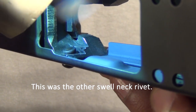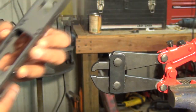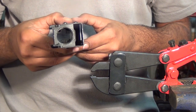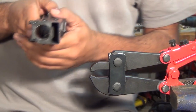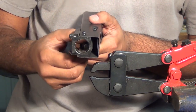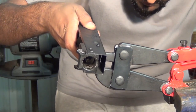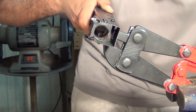Now if you can see, that bottom rivet head is not square — it's higher on one side than the other. The reason that happened is the receiver may have been twisted. When you go to fix it, you want to overcompensate. The way to avoid it is to make sure you're holding the receiver steady and straight. This side of the rivet is squeezed thinner and the other side of the head is fatter, so we're going to clock the receiver in a little bit to get it to squish on that side. It slipped off, so you've got to hold it steady — that's how you can fix it.